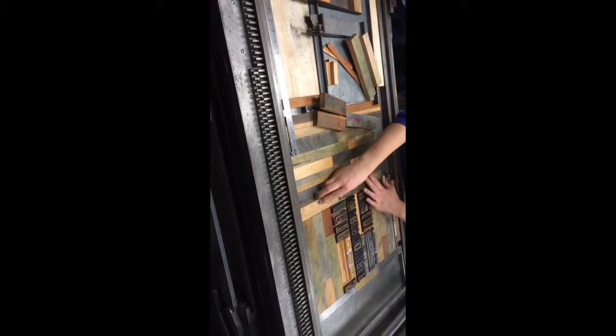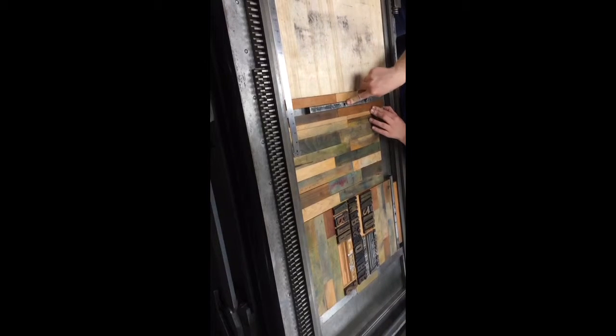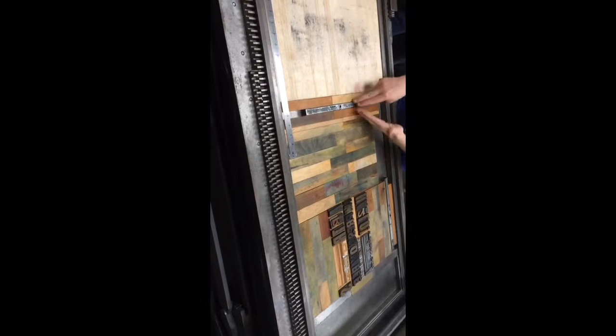What I want to do is move this nice solid line up because there's a little weird gap. Can we remove this to an out-of-the-way place? Now that we've got all of our furniture in there, we can use the quoins — this is what these are — to lock in the press the rest of the way. They expand by using the key to crank them out.